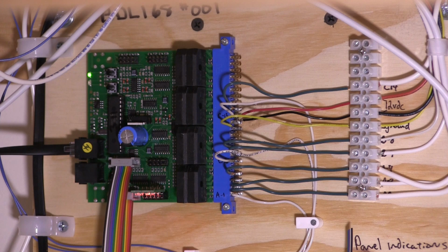And right now I'm looking at my panel. I'm running at 11.9 to 12.0 volts, and the amperage fluctuates between 1.09 and 1.06. So there is a little bit of fluctuation, but the card's been acting properly so far. If there's any issues in the future, I'll just take it off the 12-volt bus and then use a designated power supply. So if any problem arises, I'll make sure to point that out to everybody.